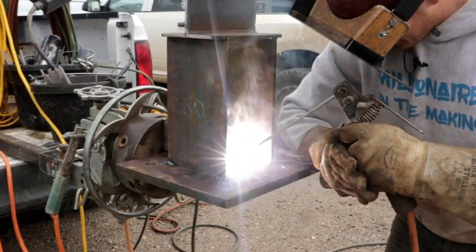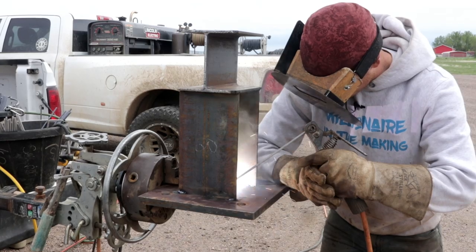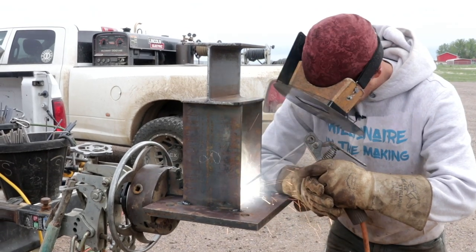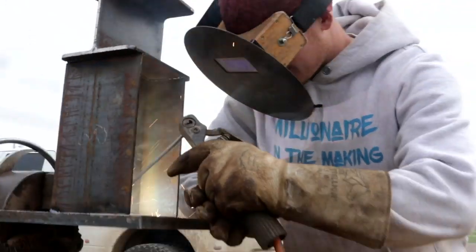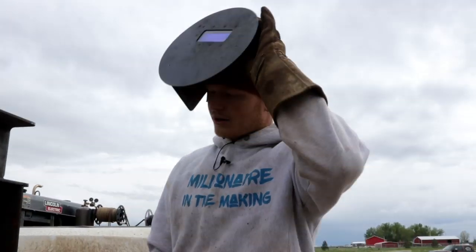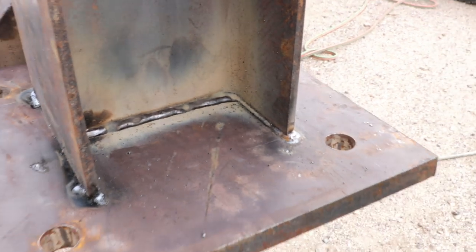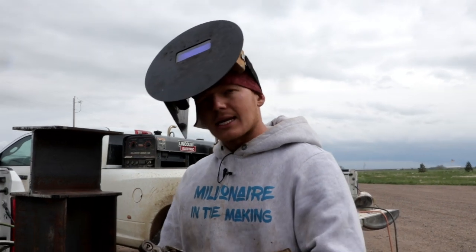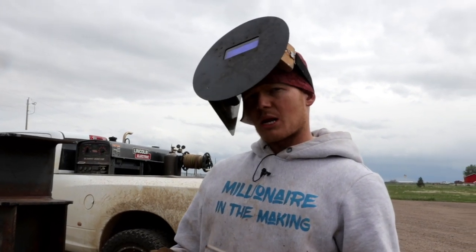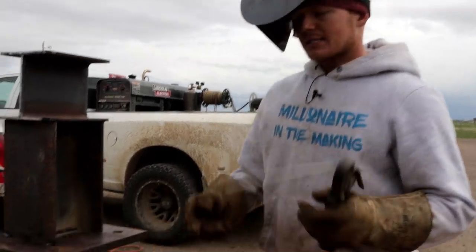The main thing is just make sure we stay tight and we take our time. You can run just a little bit faster with this root pass being in there, but not too much faster. Now you'll notice right here on the inside that we have hardly any little BBs — maybe a couple that came out, but there's hardly any. Now what I'm going to do is show you what it looks like when I weld from the outside in, just so you can see that there's not very many BBs.